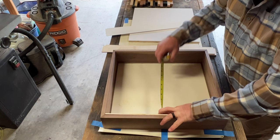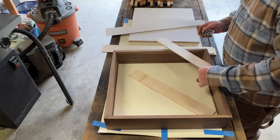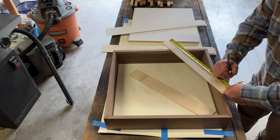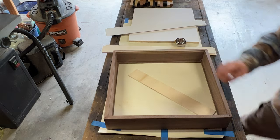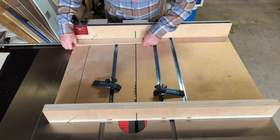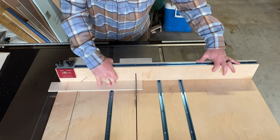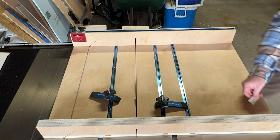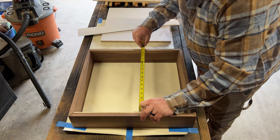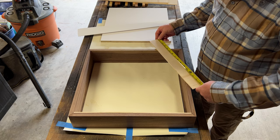I took a piece of quarter-inch plywood, measured the first piece, cut it to length, put it in, and took a measurement for the second piece. I'm going to put these in one by one all the way around, with the fourth and final piece being a snug friction fit. I took it over to the crosscut sled in the 90-degree position and cut it to the line where I measured. I then brought it back to the frame, held up a piece of mat board to it — because that plywood will be veneered with mat board — measured to that, and went back to the table saw to cut it down.